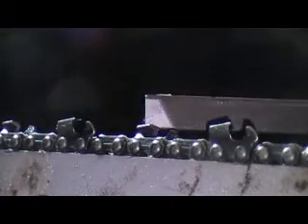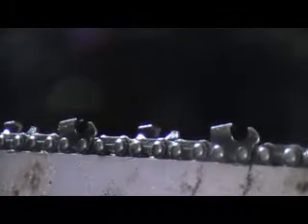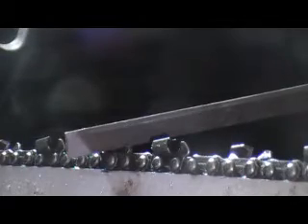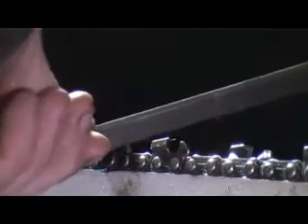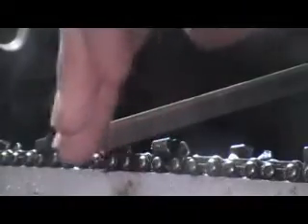Right there is a tooth I'm going to be filing — that guy right there. I'm going to do the one that's worse, which is right there. You go in like this, down at about 45 degrees, and you cut it at 15 degrees on the top plate. That's how we do it.